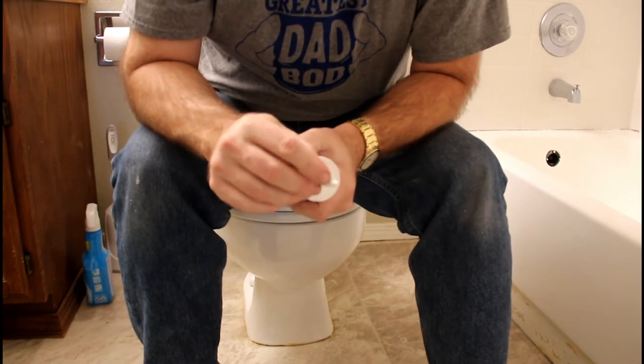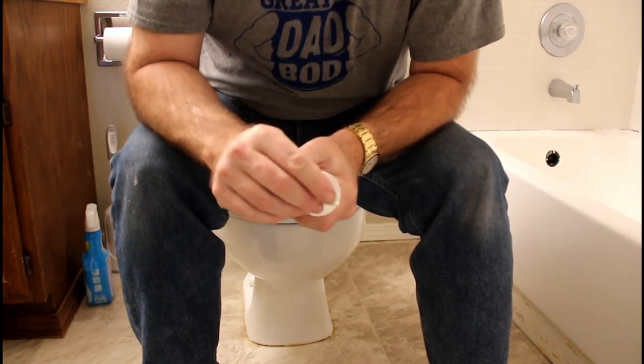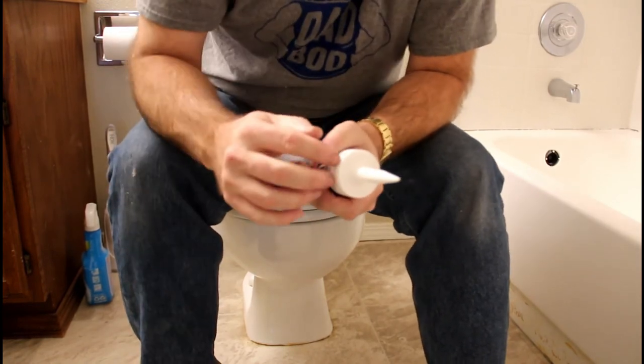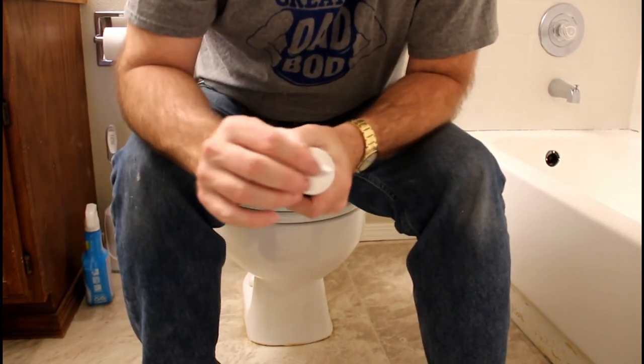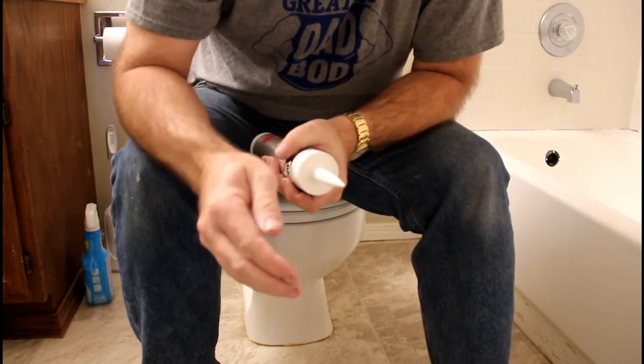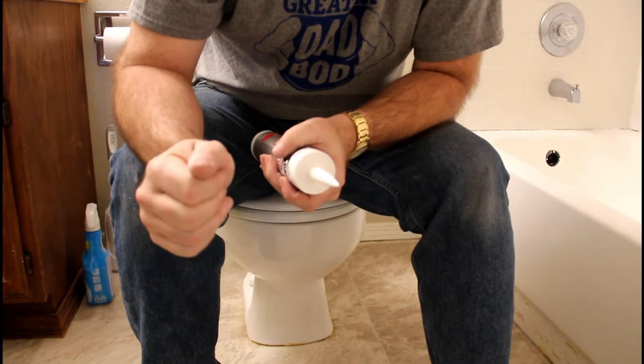So when you do caulking, you just want to take a little teeny bit off the tip. I mean, barely enough to get the little poker in if this has the foil shield in it. It's always easier to put a little bit of caulk down and have to come back than have too much and then all the cleanup that's associated with that.